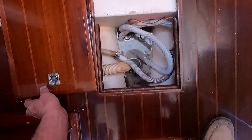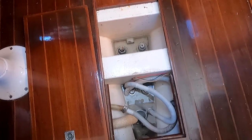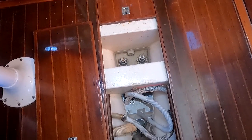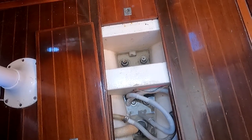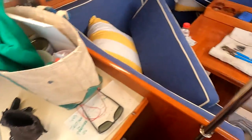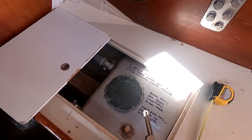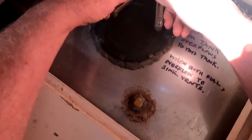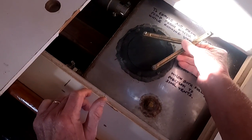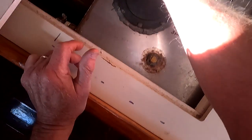Oh dear. Well, that is a little too much to account for by rainwater. My theory was that I might have a leak in the stainless water tank. So when I left the boat yesterday, I left the water pressure on because the test yesterday, after a couple of days of having a full tank, suggested that there was nothing wrong. The water level was the same. Then I thought, well, wait a minute. Maybe I have left the water pressure on and the slight pressurization that the pump makes might have forced water into the bilge, revealing a leak.